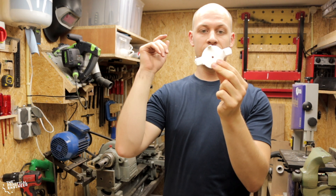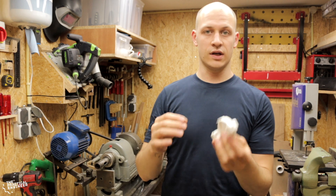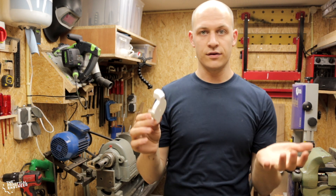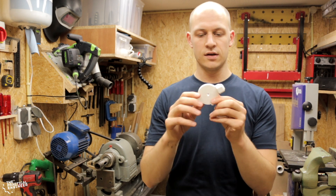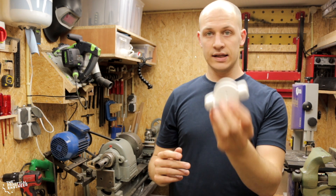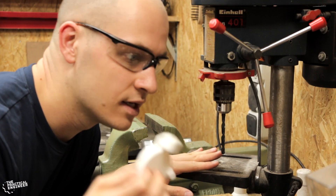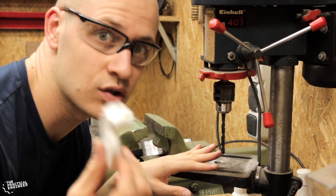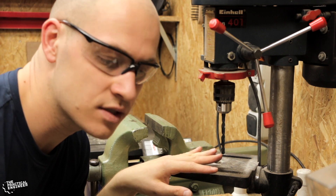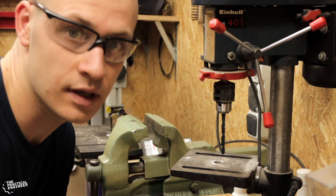The printed parts are ready. I need to drill these holes out a little bit because when you print them they're not always perfect. What I always do is make them a little bit smaller and then drill them out the last tenth of a millimeter so that gives me nice clean holes. When you're drilling in plastic — especially PLA — you want to drill very slow, because PLA starts getting soft at 60 degrees and a drill bit gets a lot hotter really quickly if you turn fast. I put my drill press in the slowest mode, and just be careful.